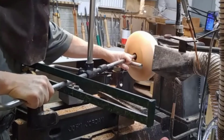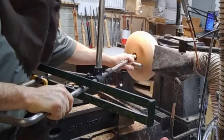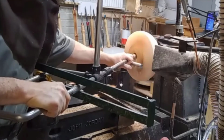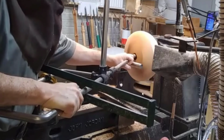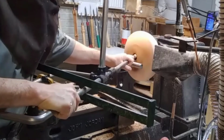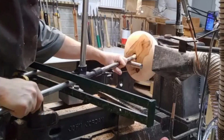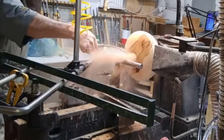Now, also, I don't think I've mentioned enough that I'm really not holding that hard. You're holding in two places, one hand with each, and even sometimes you're resting the bar against your belly, that's three places where your body is absorbing some of the vibration. And certainly when you're roughing out, you need to have at least two hands on that, but they're not holding on with a death grip, just a relatively firm grip. When you're doing the final smoothing, you don't do that. You're barely using three or four fingers maybe to just barely move the tool.